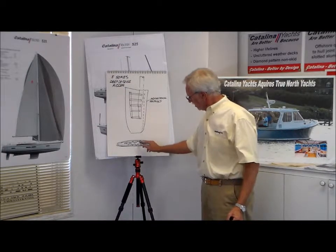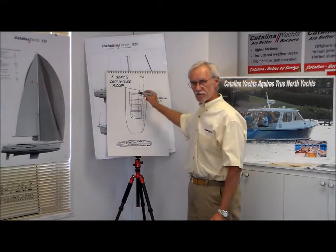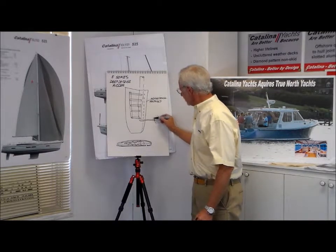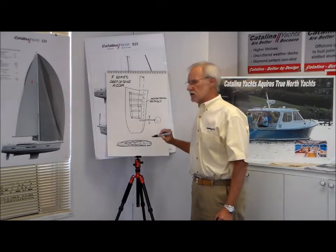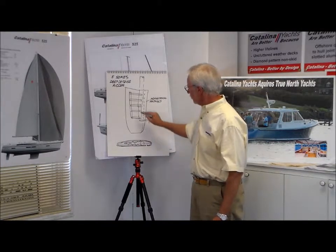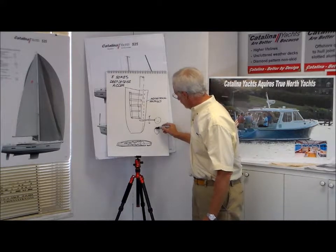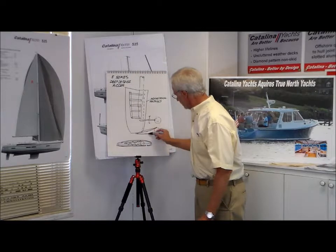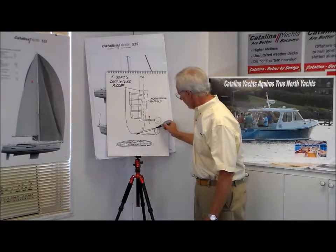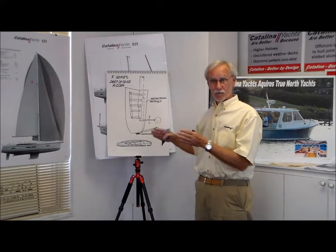That led to the idea of: what kind of plate are we going to put in there? Most rudders used to have a plate welded to the post — just a flat plate, often with perforations. But when you have a post and weld the plate to it, it's pretty easy to bend it back and forth and break that weld joint. So the thought was, when you've got a major skin and a minor skin, instead of doing a blade, let's do a web structure. We took that post — looking at it in plan view — and welded straps to one side, straps to the other side, and joined them with a plate. What that created is a triangle. Triangles are a very good shape structurally because you can't deform a triangle without breaking one of the joints. So these are extremely strong, but lighter than a full plate rudder.